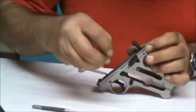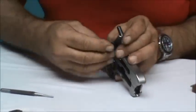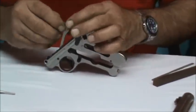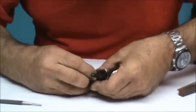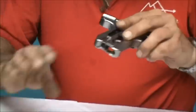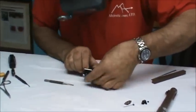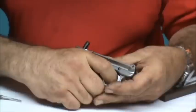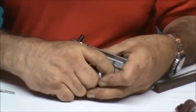Spring and plunger back into the center of the trigger. Draw out the safety just enough to keep the internal safety in place. Take our hammer arrangement into the center of the disconnector bar, look for the strut to find itself into the mainspring. Come over to this side of the frame, look through the hole to find alignment, get the safety started with the two tabs in the hole. Back to the internal safety — lift it up, hold it in place, turn the frame over, compress the spring and plunger, come to the fire position, cock the hammer. Fire. Disconnect. Beautiful. Slow release — the disconnector bar comes right back up and gets right back on the job.